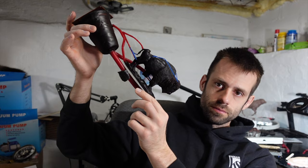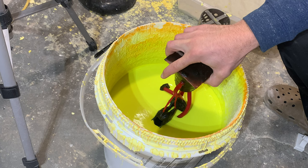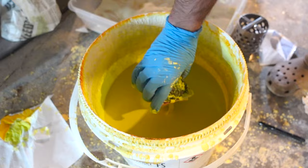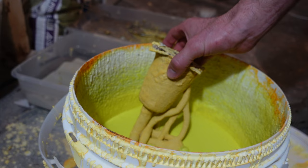Now back to the slurry model — it's time to coat it in the ceramic. I'm using Suspenda Slurry. It's a special liquid that air dries, and you put layer after layer over your model and that makes the shell to hold the molten bronze. The first layer goes on by itself, and once that's dry I'll do it again and start adding layers of sand. The sand helps add bulk and strength to the mold. Each day I add another layer, sometimes two layers in a day. I've been told to put about nine to ten layers on.